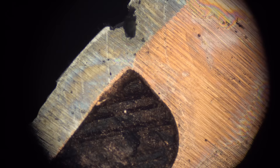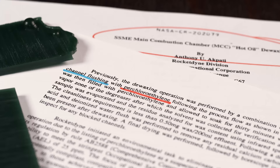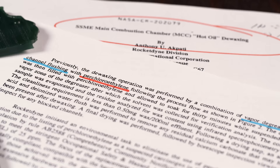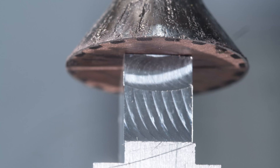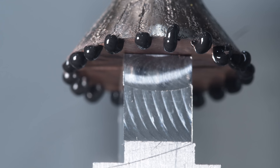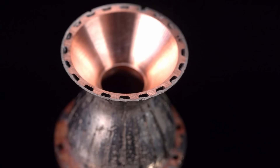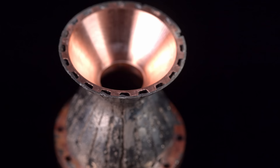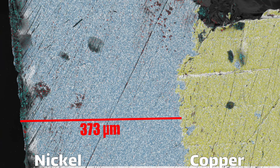When I started on this project I originally assumed NASA just melted the wax out, but in actuality I found a paper saying that they dissolved it with perchloroethylene, which kind of makes sense — you want to make sure all the wax gets out without leaving any carbon residue from a burning or melting process. I tried melting first because it seemed like the easiest thing to do at my scale, and it sort of worked, but it didn't clear all the wax. So I also ended up trying to dissolve it chemically using xylene and hot oil, like canola oil. Eventually I got the channels cleared and we can see the final result. It's definitely not as polished or professional looking as what NASA would produce — it's a little ugly — but I'm really excited that this worked at all. It's really cool to see that nickel layer on the outside bonded to the copper with just a hollow channel in between. I think I ended up depositing about 500 microns of nickel and machined that back to roughly 300 microns all the way around.